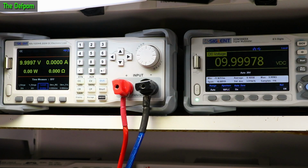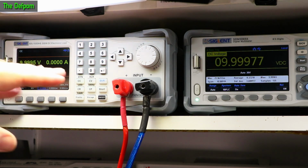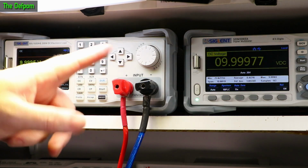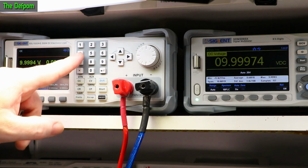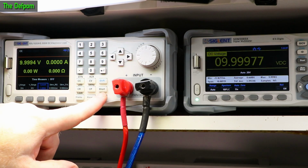Interesting. So I'm going to change the view to multimeter, which is measuring directly on the output terminals of the power supply and the load. Reason being, this load does tend to get a lot of voltage sag when not using external sensing. The external sensing connectors on this thing are on the back. I'd rather just hook up the multimeter and use that. It's just easier. So let's actually do this test again. Let's do back to 1 amp, which will turn the load on.